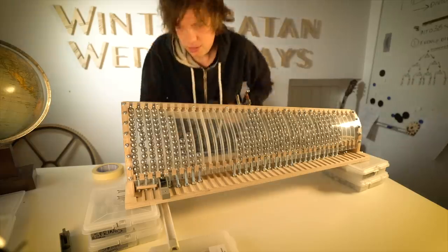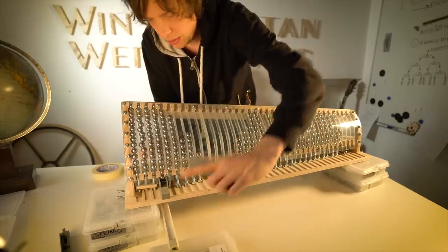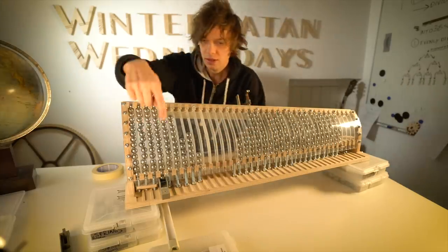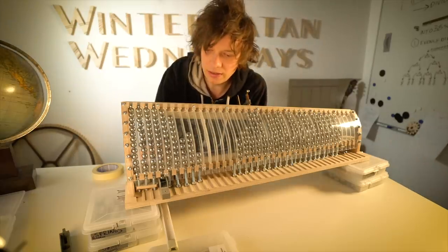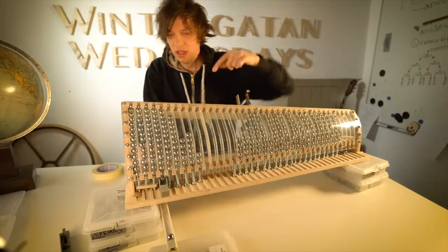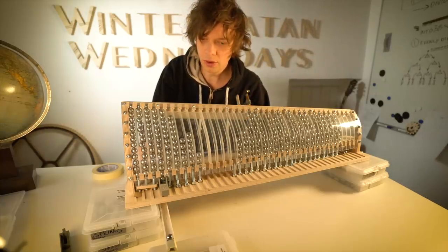And this gray thing here is the same thing down here. They are mechanically connected to the programming pins, and when they shift backwards from a hit of the programming pin, they will release one marble to go further down into the machine, like this. And when it's going back to its original position, it will load a new marble inside the gray thing from the queue, like this.